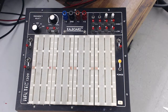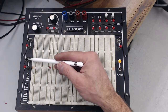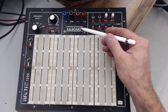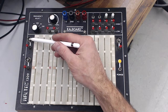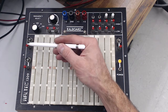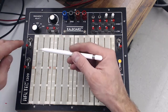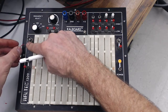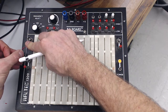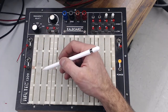Let's talk about each of these in turn, starting with the coax connectors. The outer conductor is connected to the chassis ground of the protoboard. The center conductor is the one whose voltage can vary relative to that outer ground. It's connected — indicated via a white line — to a little connector here. You push down on the red thing, insert a wire with a bare end from the side, then let go, and it's clamped. Now this wire is connected to the inside of the coax.